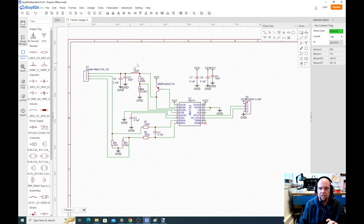The way the software works now is the schematic tells it every component that it's using. For each one of those components, it should have a footprint that it knows it's using. We chose parts directly out of the library, so they automatically attach a footprint to a schematic symbol. If they didn't, there's an extra step where we'd have to create footprints or attach footprints to each of the components. In our case, we should be okay as is. So what we're going to do is take this schematic, which defines how all the things have to be connected and all the components.